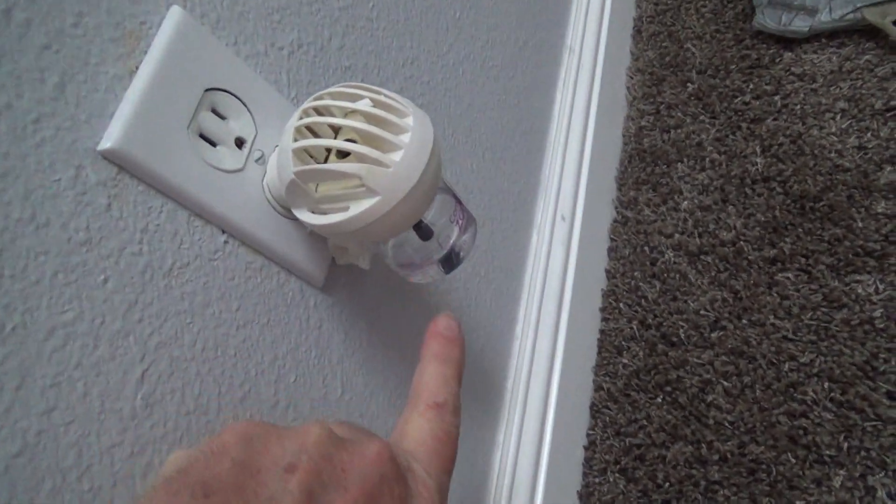Isn't that something? I would never really do that in a kitchen. These are on 20 amp circuits — you saw that in the sub panel. They have 15 amp GFI outlets, and they also have 20 amp GFI outlets. There's a reason why: if you put the 15 amp in there and you overload the circuit beyond 15 amps, it's going to trip the 15 amp GFI before anything else, and then it's going to trip the other electrical outlets that are connected.